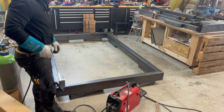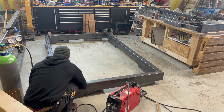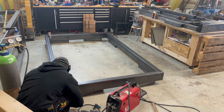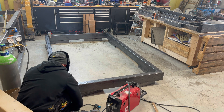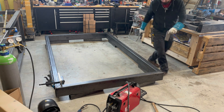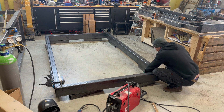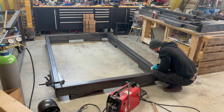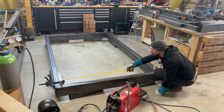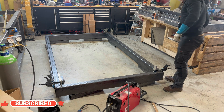It's easier to have it in by a millimeter or two, and that will help it draw back outwards. All you need is two tacks, top and bottom of the outside corner, and this frame is pretty much done. I'm moving the aluminum block to the opposite side — parallel to where I was welding — to ensure the diameter is still 1.5 meters internally. This also helps with the squareness of the frame. I spent about 30 minutes switching sides with the blocks just to make sure everything is perfect.